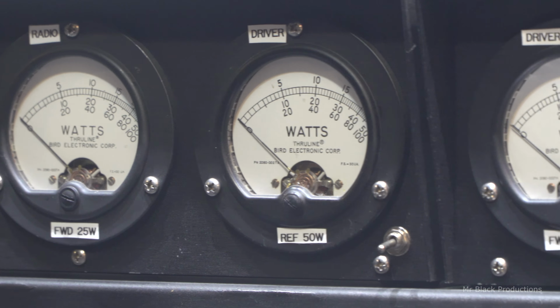It's just three diodes with the anodes facing each other, and the cathodes attached to each one of the output legs of each one of the phases. And that's what drives this regulator. We undo this little bolt here, this little nylon nut, and that allows us to have access to the screws that set our voltage level.